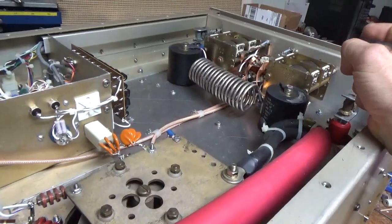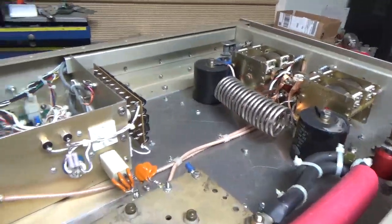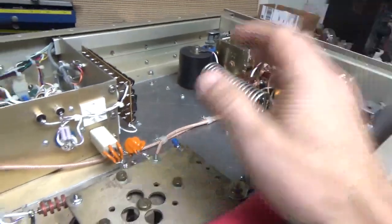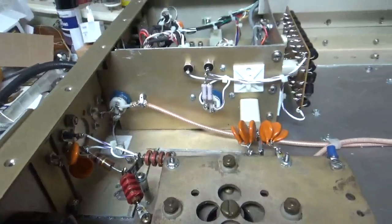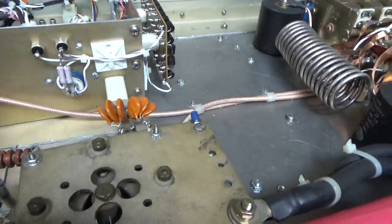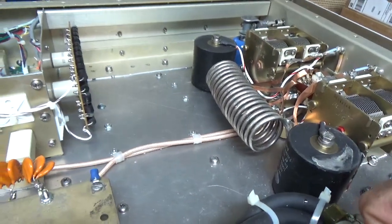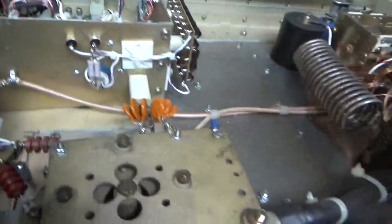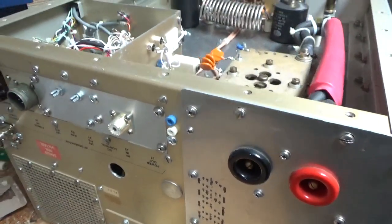Can't wait to see this thing fired up, but I already know it'll work. I know the input and output networks will work — they've been resonated. Might have to tinker with the protection circuit a little bit, but everything else I've done over and over. There's a massive filament choke. Thank you very much for sticking with me on this project and watching and making comments. Next will be the power supply, which will be a lot less work and a lot less complicated. This RF deck was very, very tedious — all Teflon wiring. Again, thank you. Have a good night. Stay tuned. 73.